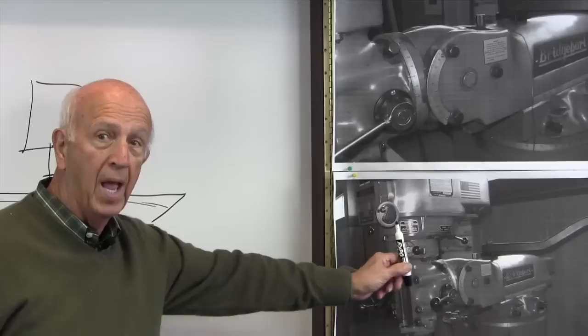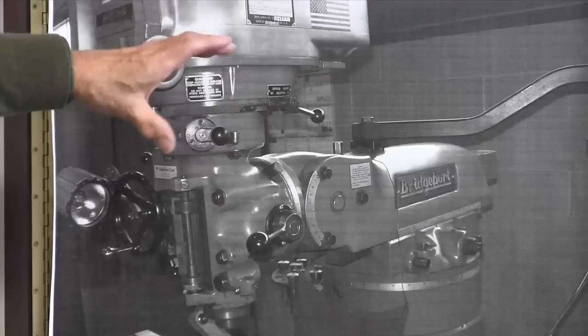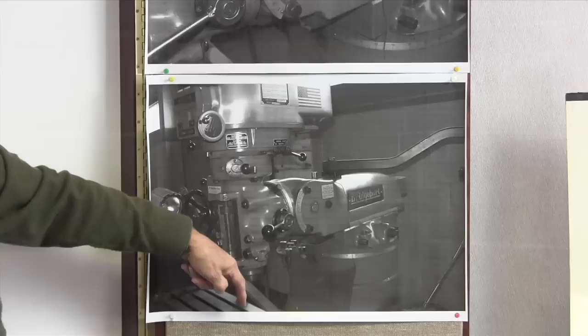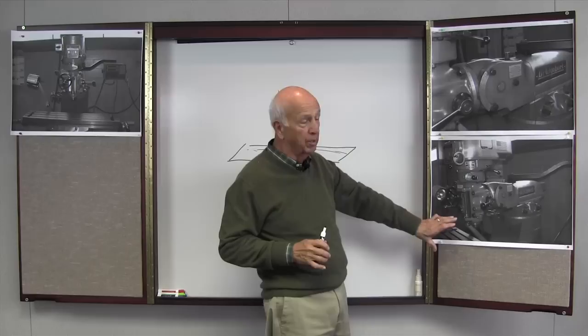It's a little tricky because this thing is really heavy and just does not want to cooperate. One of the problems to think about is that when you're adjusting right to left, that's not such a big deal — it's pretty easy because it's on its center line. But when you're going front to back, that gets tricky. Why? Because the pivot point is here and the back of the table is closer to the pivot point than the front. So if you're off twenty thousandths — high here and low here — you'd think you could split the difference with ten. It doesn't work that way, folks. It's really tricky to zero in.